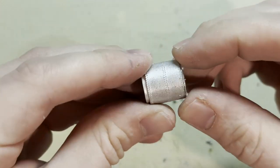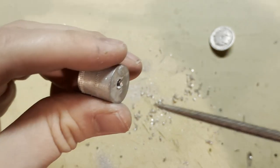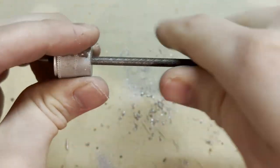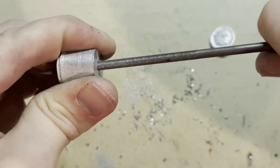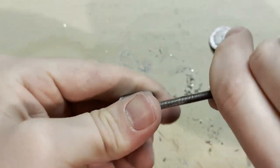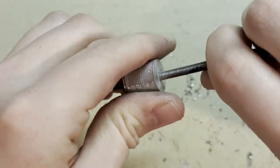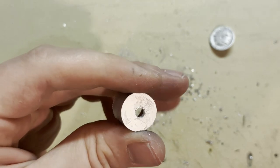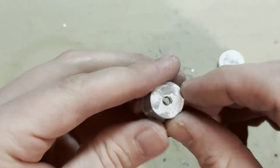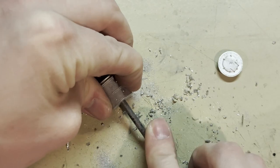It's not quite going on straight. Actually it might be safer to use the round file here — this way I don't risk hurting myself with the power drill getting caught on that hole, which it seems to be doing very easily. Part of that is just because of the softer grade of metal. Sometimes when you're drilling a metal like this, it can sort of form itself around the drill bit, then grab onto it and it's hard to get the drill bit out.